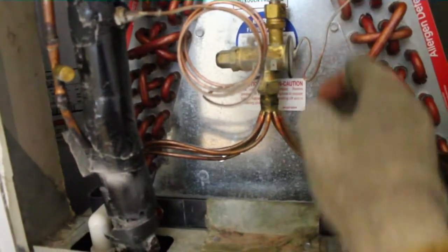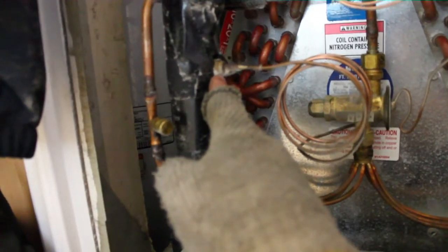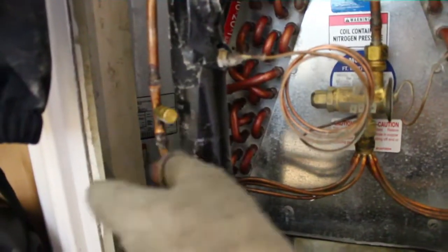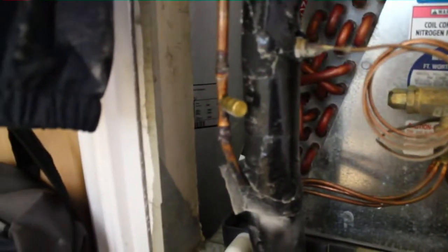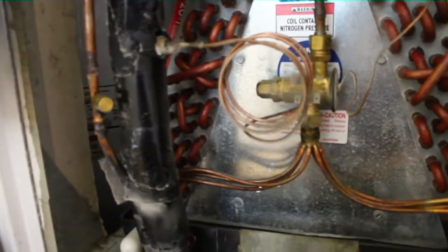What I'm going to do is unbolt this TXV just like a regular Goodman TXV — unbolt it here and here, take it out. Take where the equalizing line goes into the suction line, take it off, put a Schrader valve in it and put a cap on it, and we should be good to go. We'll have caps here and there. I can't remember why I put a cap there — maybe I was pressure testing and it was raining. I don't know.